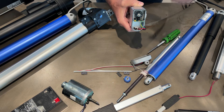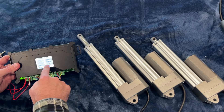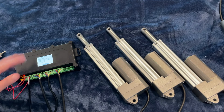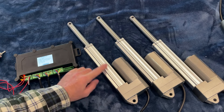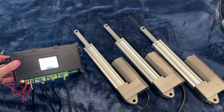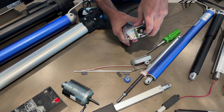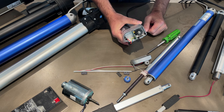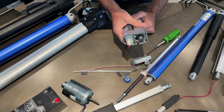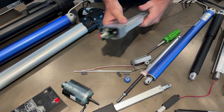The optical sensor just counts pulses. Whatever control system you have must have a homing sequence built in so it goes all the way to one end, sets the count at zero, then as it goes to the other end it counts all the different pulses and divides them over the entire stroke to give precise control of the distance moved. One pulse here is around one micron of movement in the rod - so that's very very good positional control.